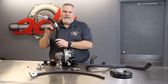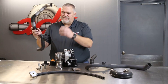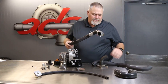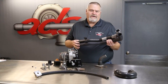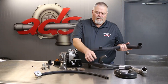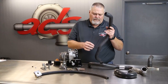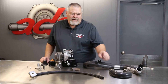One of the other pieces we made during the mock-up was the exhaust pipe. We took parts of the stock exhaust pipe and had a friend bend us some tubing so we could make couplings, then tacked everything together so it would go on the turbo and down the side of the tractor. Once we had the pipe fabbed up, we sent it out to a tubing bender, who returned this pipe that fits on the tractor wonderfully. Future kits will also have the tab welded onto the down pipe, ready to go in the box.